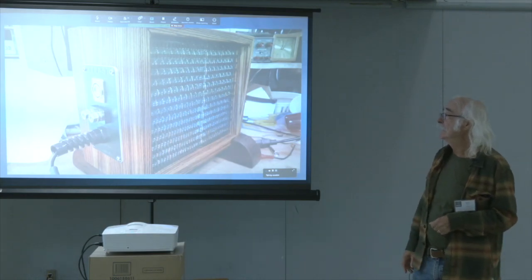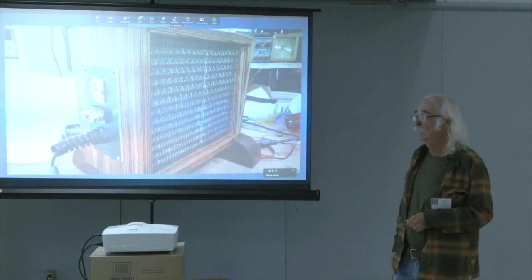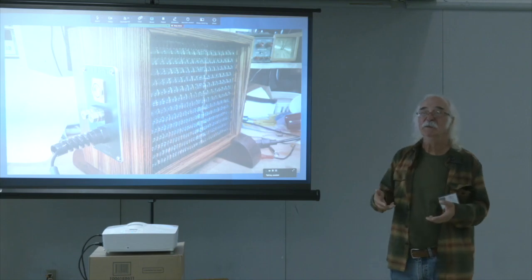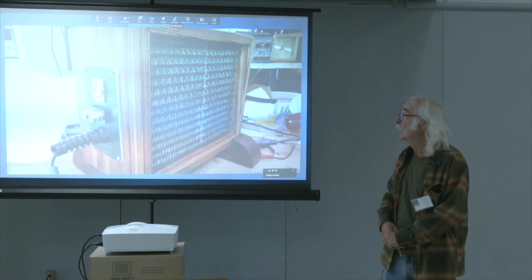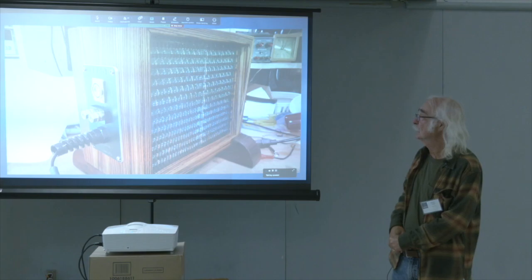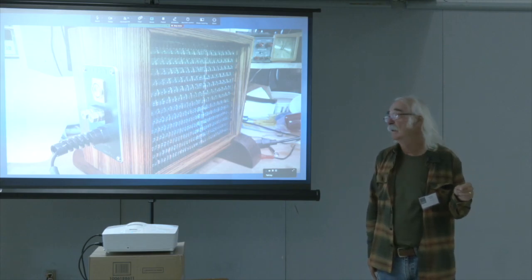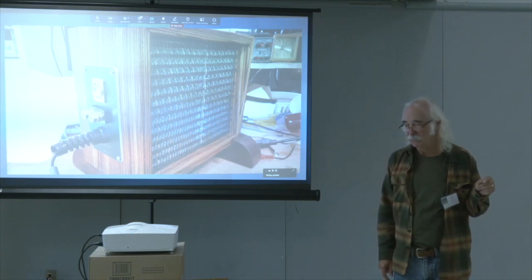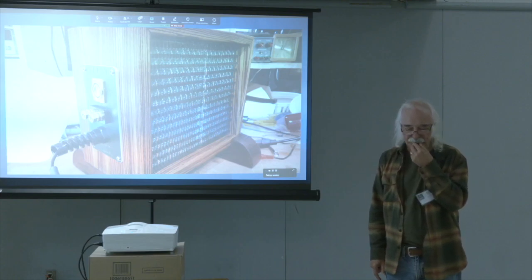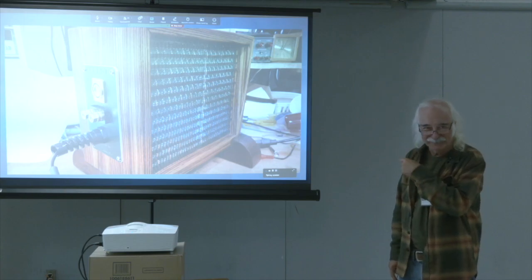Next, please. Later on, in fact, about 2 years ago, I built a smaller one, and the intent on this was, well, we can do this over again, and maybe it'll be an overgrown headphone amp, or maybe it'll just drive some normal speakers. It doesn't have to be so powerful, etc. In this case, however, I did something a little different. First off, I used fewer JFETs, but I also used cheap JFETs. And the cost of these at the moment compared to what you pay for the J74s and the 170s is, yeah, a 100-to-1 ratio. So you can afford to build this.